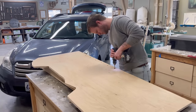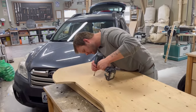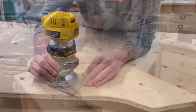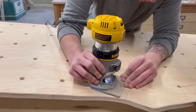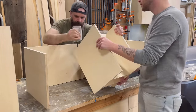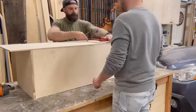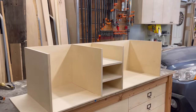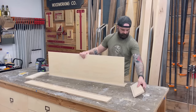While I finished up the cabinets, I convinced Nathan to start drilling a zillion holes into the sleeping section of the compartment. After drilling the holes, I had him hit each hole with a little round-over bit — just to get rid of any splinters. Don't want him to get splinters in that 25-inch backside of his. By the time he was finished drilling, I was ready to hook the cabinet together. I had him hold it in place while I glued and tacked everything down, tacking the top of the lower drawer to the bottom of the cabinet unit. We'll put that in place after securing our drawer slides — I wanted to leave the top open so we could easily access those slides. But first, I had to build a drawer.